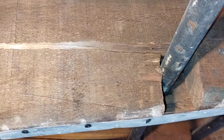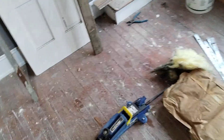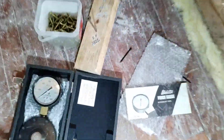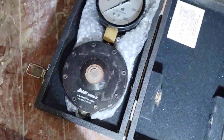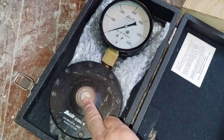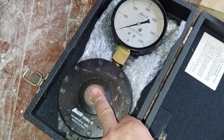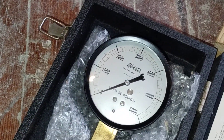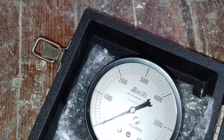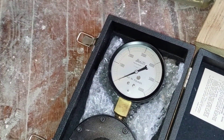So there you have that knowledge. Now, to determine how much loading is on there, I use a pound-force gauge. What you do is put your pipe or whatever you're working with onto a load cell and it will tell you the pounds of force. Once you get it level, you know how much weight you're actually dealing with – how much load – and then you can add a little bit more of a margin to it.